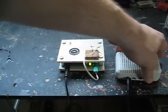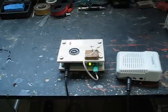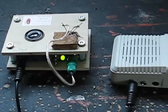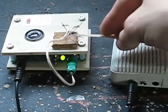Now the only thing running is the spiker box and the battery-powered speaker. Notice how clean and crisp the spikes sound. As a rule, turn off all devices plugged into the wall sockets around your spiker box. Now that's a response!